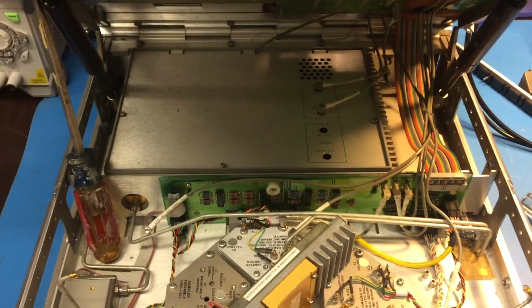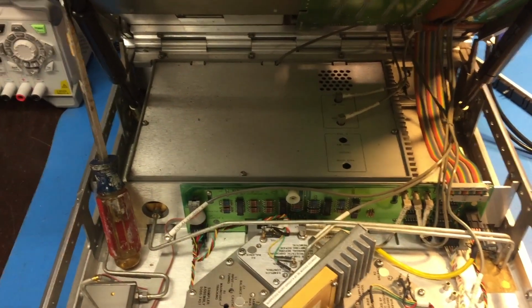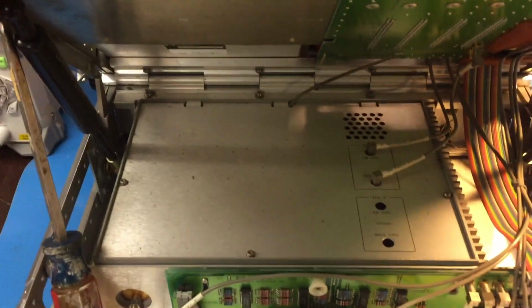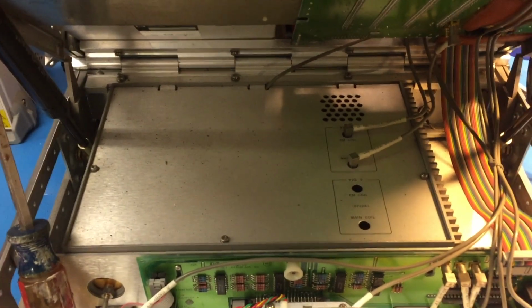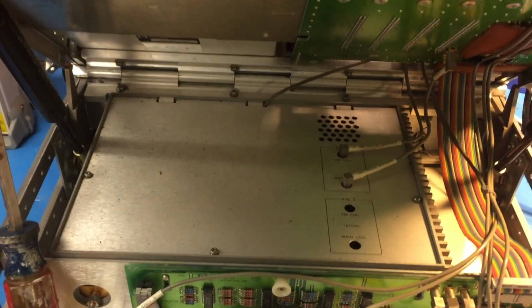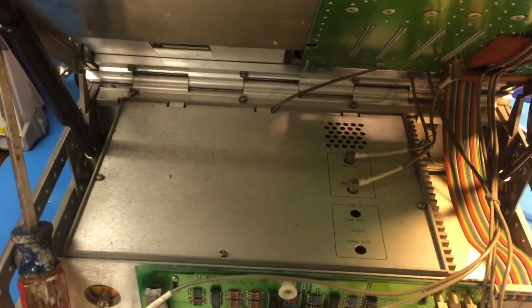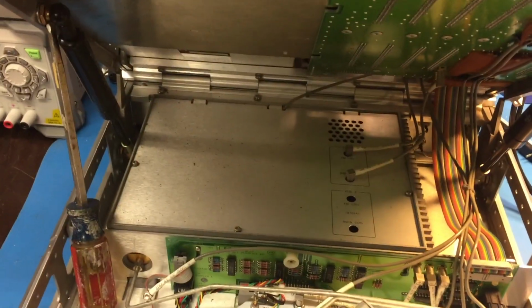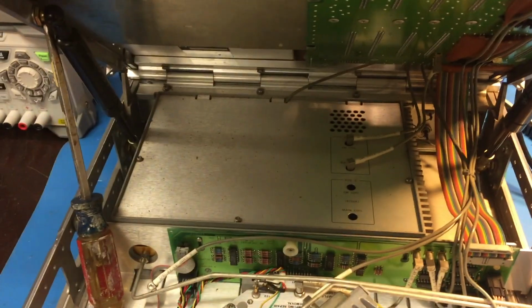There are usually 2 coils to change the magnetic field around the yttrium iron garnet nodule. There's a faster FM coil, and then there's a main coil. So I'm going to take a peek at the FM coil driver and just inspect it and see.